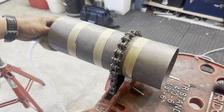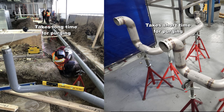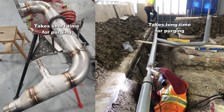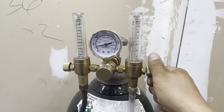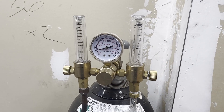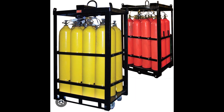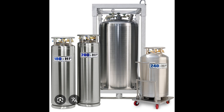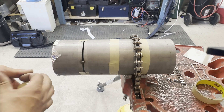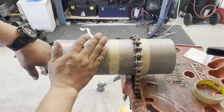How do you know if purging is working properly and you can start welding? You have to wait until the pipe inside is filled with argon gas, but it depends on pipe size, spool length, and purge gas pressure. I turn on the purge gas full blast with a regular gas cylinder, and lower the pressure with a bulk pack or liquid argon since those are high pressure. I feel the purging gas pressure with my hand — if it's too high, I make bigger vent holes; if it's too low, I make smaller vent holes.